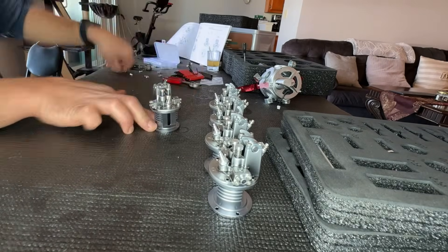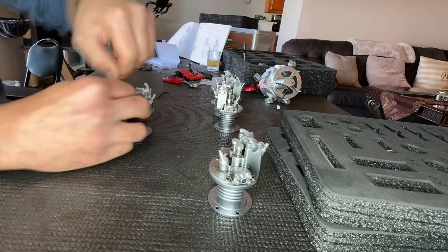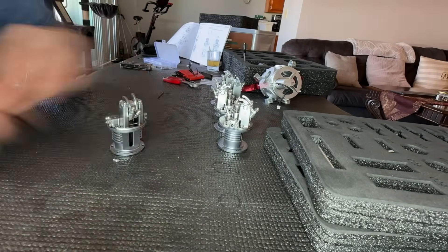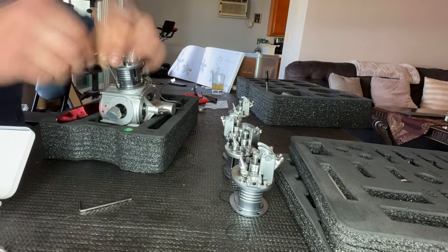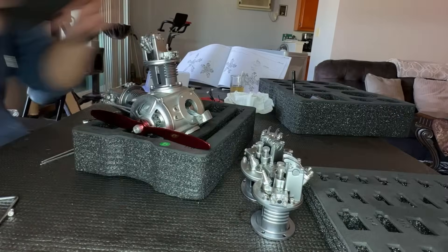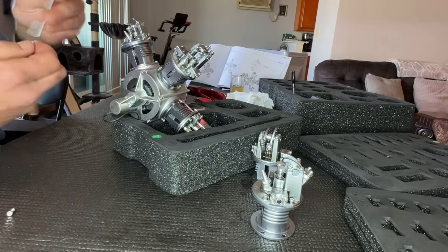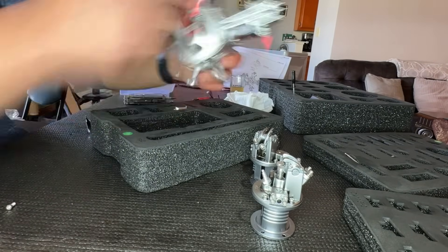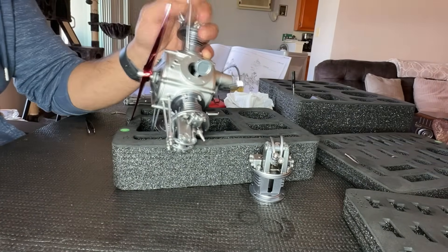We're down to the home stretch — got the cylinder heads finished up and we're going to install them onto the cylinders, then put it onto the block and slide the pistons in. In reality there are more complicated components involved such as piston rings and bushings, plus compression checks. Notice the fins on the cylinder itself — these radial engines, like any modern propeller engine on your Cessna 172s or 150s, are air-cooled. Most of these modern propeller engines are also direct port injection and usually have dual spark plugs timed by a magneto. Since this is a radial engine, the cam is on the inside — it's called a cam plate, concentric with the crankshaft. As the crankshaft turns it spins the cam plate, which has little divots; the divots push the push rods up and then the rocker arms move, opening and closing the intake and exhaust valves.